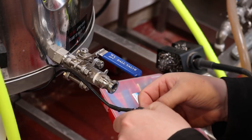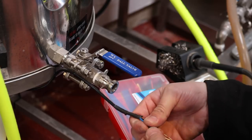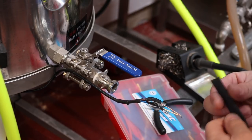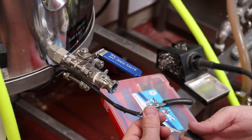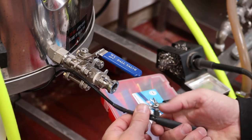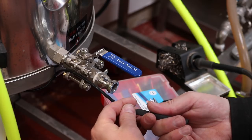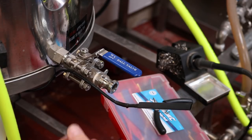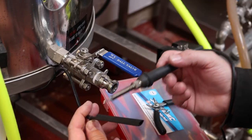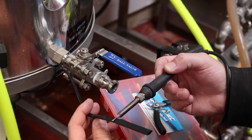And looking at the probe, I think this is bang on. The temperature is much closer to ambient. We'll of course reset that shortly, and we're just going to put this bit of heat shrink on top of here, and I'm hoping this will shrink down to the right size just by stroking it backwards and forwards with the tip of the soldering iron.